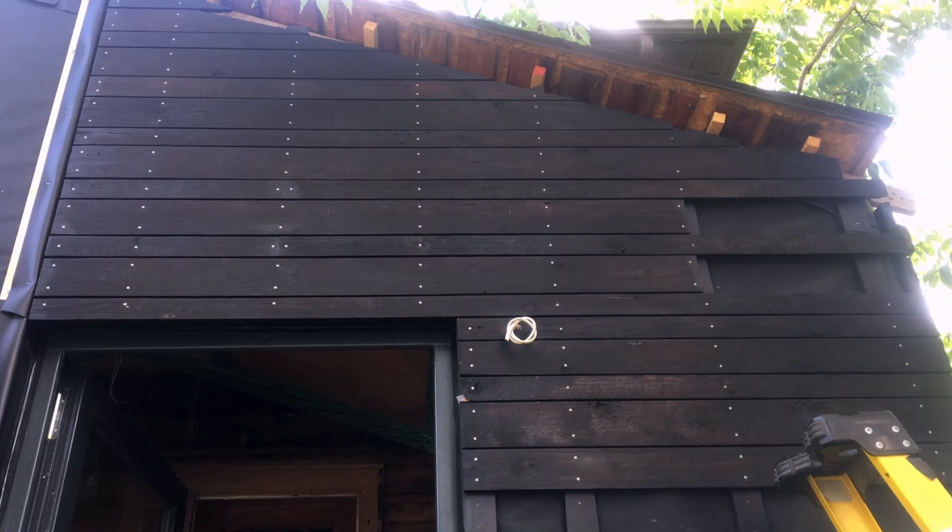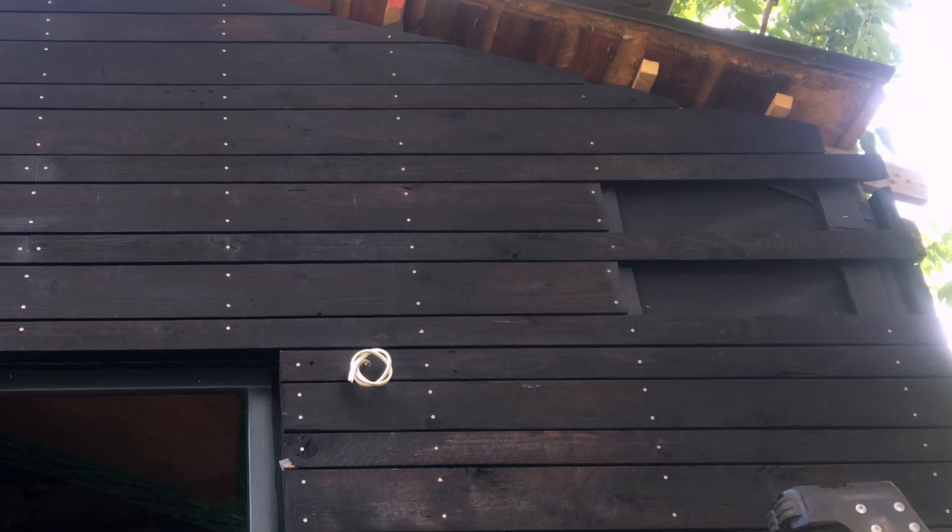What I find very attractive about this facade is that I use no chemicals to treat it, so there's nothing that can wash off into the ground that is dangerous. It's also very easy to maintain — I could easily remove specific boards to do work behind them or replace them if needed. Coming closer to the board, you may notice there are open gaps. This is very untypical for residential homes here in Canada but very popular in Germany. One concern is that insects may get in, but the observation has been that behind the facade there's a fairly active wind stream — when the facade heats up, air streams upward and insects don't really like that.